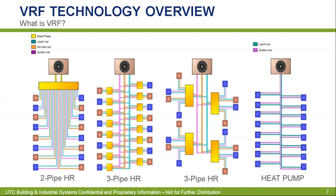The flow selector sends cold refrigerant from the outdoor unit to the indoor units that want it. When those indoor units use the cold refrigerant and send back hot refrigerant, rather than sending it back to the outdoor unit to release into the atmosphere, the flow selector sends that hot refrigerant to the zones that need heating. That's how a heat recovery system has the ability to do simultaneous heating and cooling — you're essentially moving the heat from areas that need cooling to areas that need heating through refrigerant.